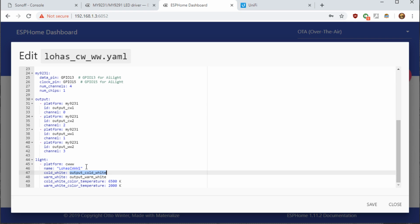Now, to map cold white to warm white, you can only map one channel to one. Again, you'd have the same issue with Tasmota, that you would only have half of your bulb working. So thanks to Otto, he did send a custom component which allows you to dual map channels in ESPHome. And I will put a link in the description of the video which shows all of how to copy and paste that into a file. And you do need to put that in your ESPHome folder in your config folder on your Home Assistant device, wherever ESPHome is stored, whether it's in a Docker container or in HASS.io. You should see in your config folder in ESPHome.